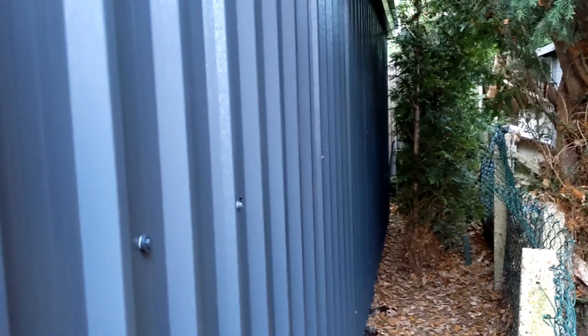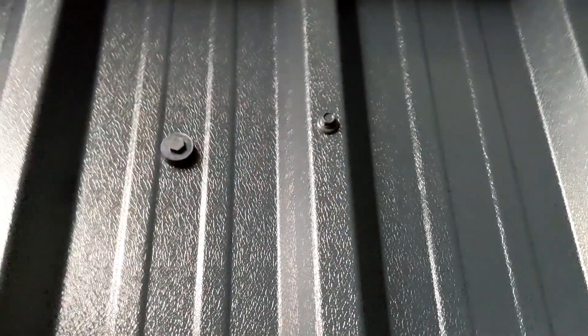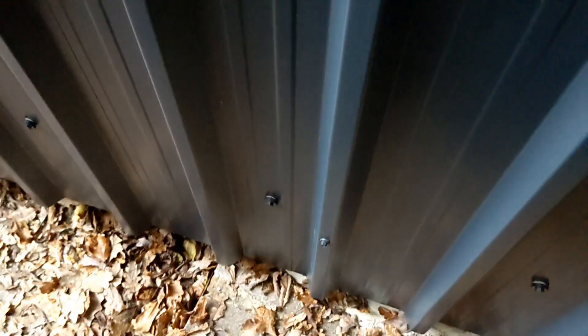Okay, so it's a couple of hours later. The cladding on the back is now done. We've got all the screws in. I replaced some of the ones at the beginning where they were over-tightened. We've now got the cover caps on — just little caps which push over to the top. So I did three rows: one at the top, one in the middle, one at the bottom. The laser level was really useful because it's magnetic, so once we had one panel up we can fix it on, get the line, and make sure the screws are in line with the batten. Then between where the panels join, just at the same level, I used those stitcher screws which I had left over from the roof, just to attach the two panels together. I don't think it even really needed it, but I did anyway.